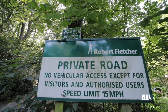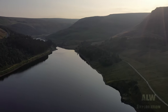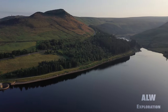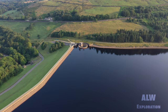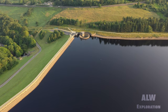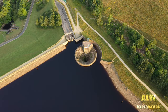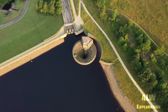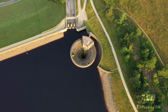This is a process that requires a huge amount of clean and pure water. Originally, a stream giving the motive force for the mill's water wheel was converted and built into this huge reservoir that was constructed between 1958 and 1965. This supplied up to 20,000 cubic meters of water each day, which was free from dissolved salts and color. This is a requirement for paper.